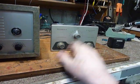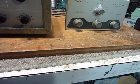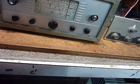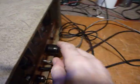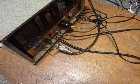What the Q multiplier does is it has a regenerative effect which gives a stronger signal when you tune it in, and you're tuning across the 455 kilohertz IF frequency with the Q multiplier. That's a piece of equipment I recommend — the QF1 Q multiplier. When I got this Q multiplier, this plug for the power was wired for a different radio, an S38 Hallicrafters or an S40, so the first thing I did was pull that cap off and make sure it was wired correctly for the AR3, which it was not. You get that wiring information from the AR3 manual or from the QF1 book.